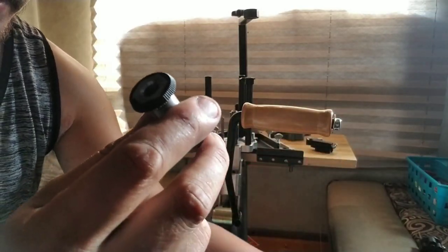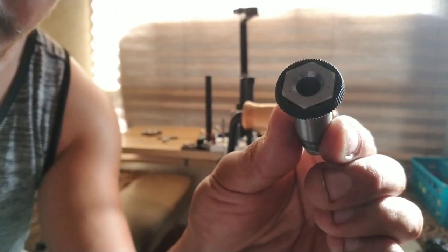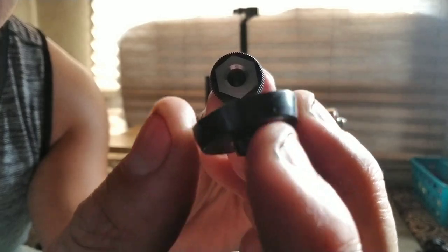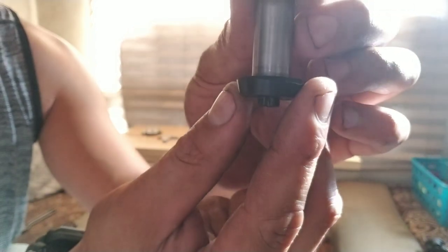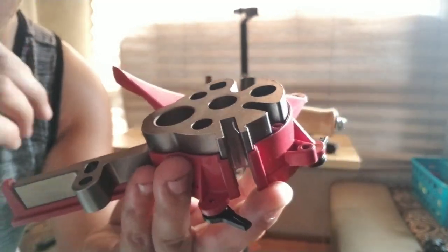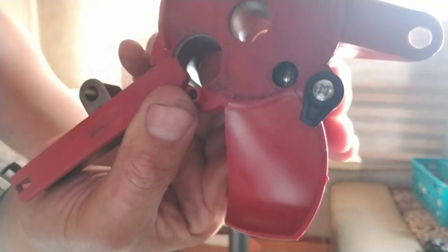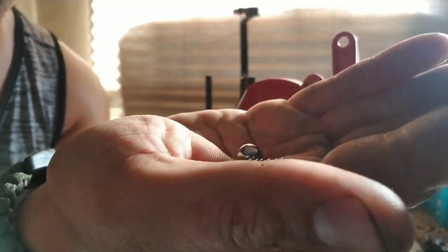This is the cool thing about this press — it's a whole different kind of timing mechanism. It kind of looks similar to a rear differential pinion gear. The inside cap also has serrations in there. Basically, how this works is when the press goes up, this cap falls down and allows it to pivot. Before you start manipulating the carrier assembly, note that you do have an index detent ball and spring inside the carrier itself. Before you tip it over, the detent ball and spring are right there — don't lose them. Just tip it over, let them fall out, and catch the parts. Don't let them roll around, and don't lose the spring.